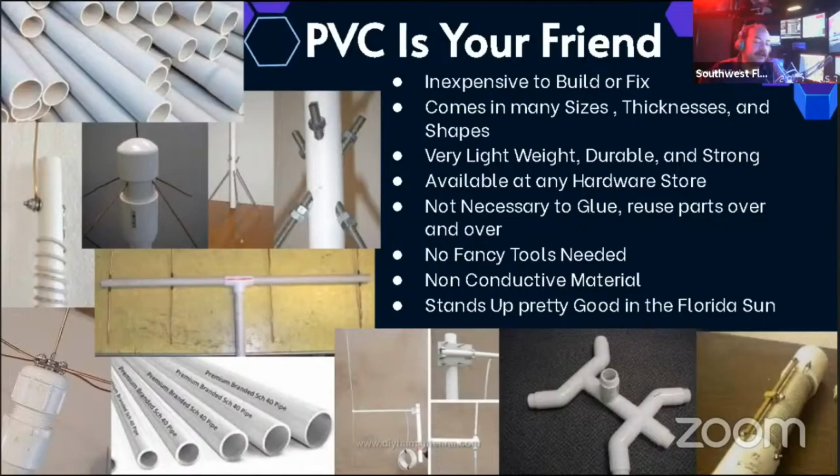Anyway, it's a non-conductive material. Let me tell you what, I honestly believe no matter what calculation you make, or how you try to figure out the math, antennas work better when the boom and the mast are both non-conductive. You just seem to get this amazing resonance with it, and you don't have as flaky an SWR. When I build these out of PVC, and the only metal on it is the pieces that are actually the antenna, SWR is easy. I rarely have to put any loops or anything on it.